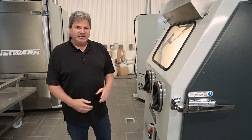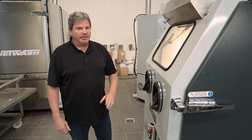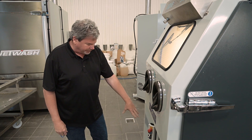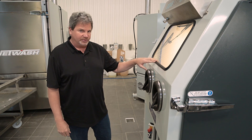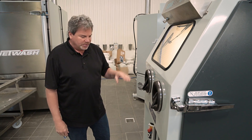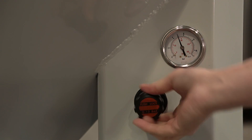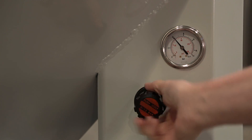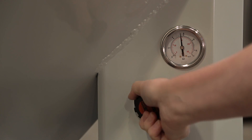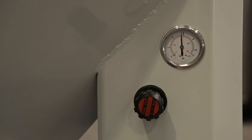We've phased the machine, set everything up, got the abrasive and water in, and we're ready for basic operation. It's really quite simple — you go back through the startup here and just turn the machine on. When you look up you'll see the light is on so you know you're ready to go. Your air pressure regulator is over to the right-hand side. You normally blast between 60 and 80 PSI — that's going to depend on what you've done in trial processing and your learning curve as you use different abrasives.